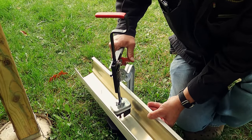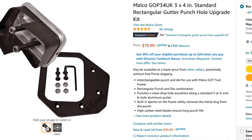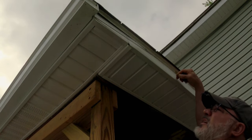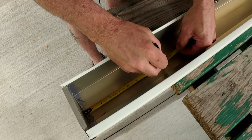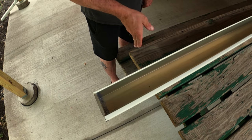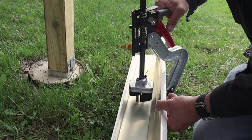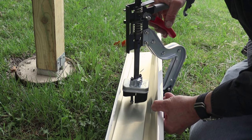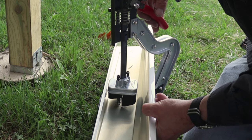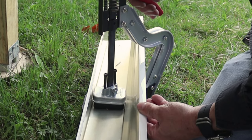It literally took two minutes to use. The dies for this punch are sold separately, and there's a few styles to choose from. I'll be sure to include the Amazon links below, which by clicking the link and then buying anything from Amazon helps this channel out a ton. After determining where the hole is going to go in the gutter, and which orientation it's going to be in reference to the gutter — long ways or across the gutter like mine — you just simply square it up and repeatedly squeeze the handle until you hear it pop through.